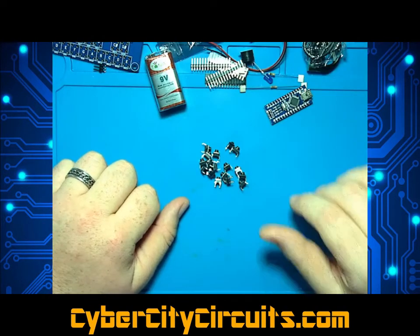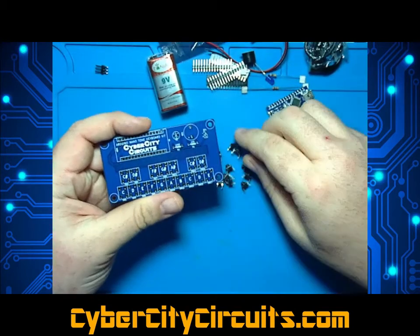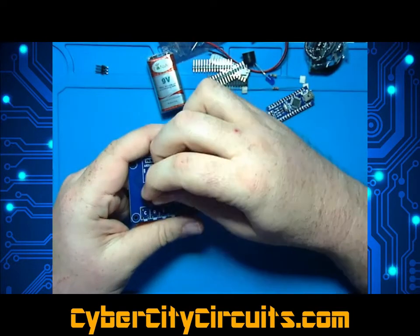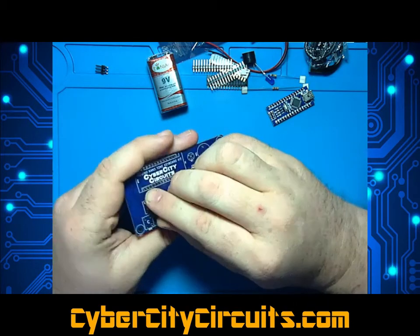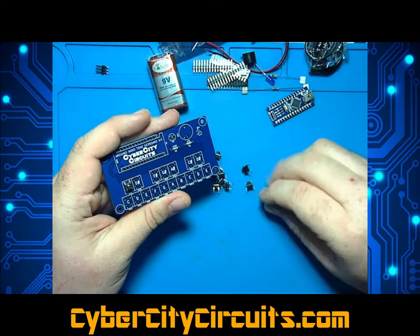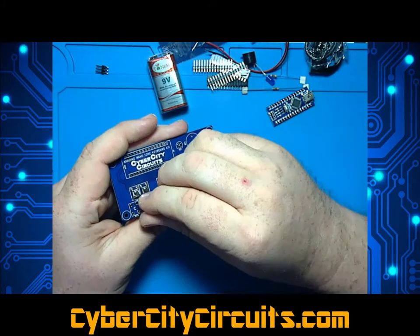Now that we've done our safety rules, let's get started. So the first thing I want to do is I want to put these buttons on the board. Now there's 17 buttons, and I could just put all 17 on at one time, solder them all in, but you're going to have some trouble when you do that. So what I like to do is I like to do like 4 at a time. It makes it a little bit more manageable.